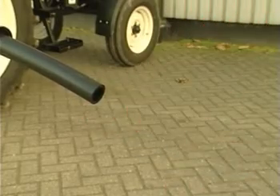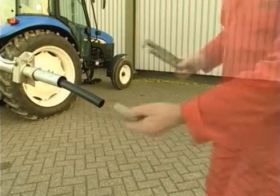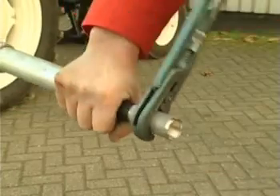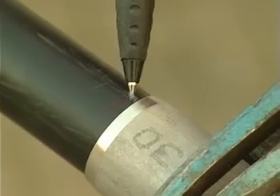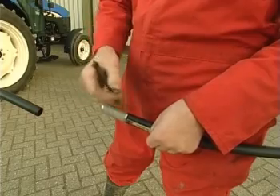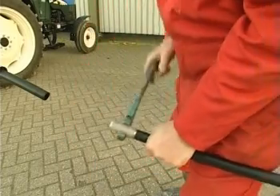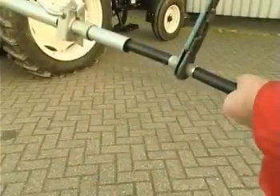Hose leaking? Remove the damaged section. Place a mark on the hose that comes out of the machine at 35 mm from the end. The repair bush has a left-handed thread on one side and a right-handed thread on the other. Screw the right-handed section on the hose as far as the mark and then back off the hose counterclockwise. Do the same for the other hose section, but screw on counterclockwise and back clockwise. When you have nearly screwed the bush from the hose, insert the first hose section into the open end of the bush.